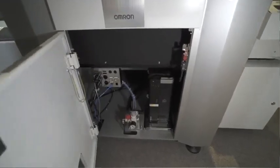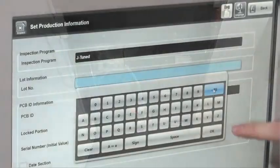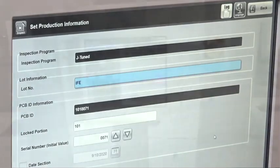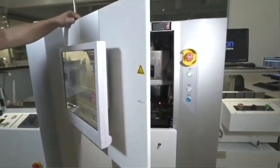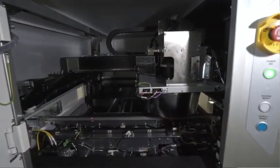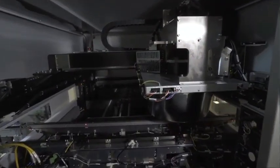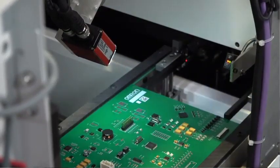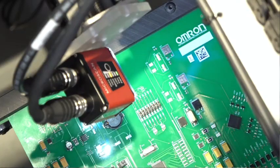Operation is made simple and user-friendly with integrated touchscreen controls and almost no routine maintenance or calibration required. The VTS 530 3D AOI can handle PCBs up to 510 by 680 millimeters, up to 4 millimeters thick and up to 4 kilograms in weight. Physical top and bottom side PCB clearances are each 50 millimeters.